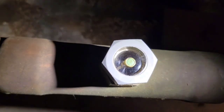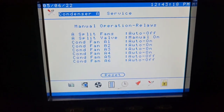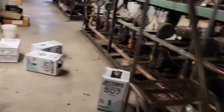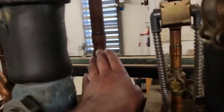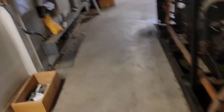Hopefully this will fill up the receiver and clear that sight glass. As you can see, the sight glass is still flashing, so I'm going to put it in split and see if that works. After turning off that liquid header and manually putting it in split, we now have a clear sight glass. This definitely has a low refrigerant issue.